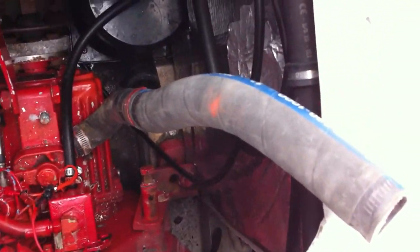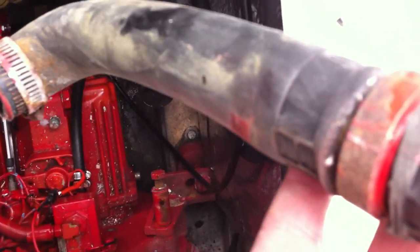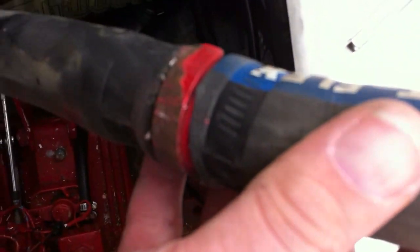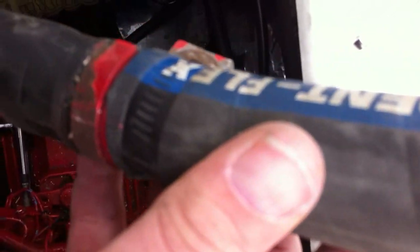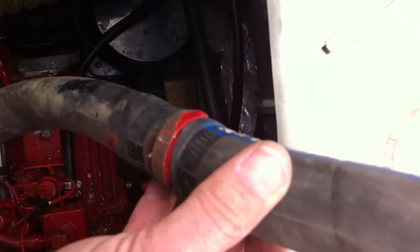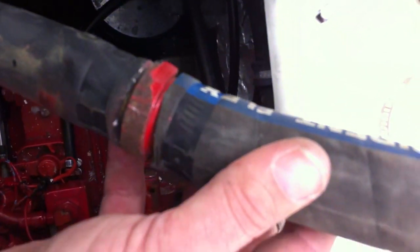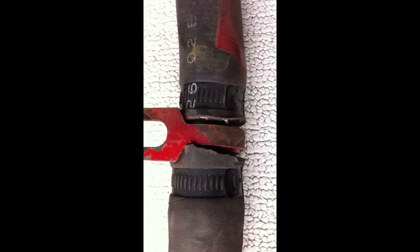Here's the hose from the bottom of the transmission - got it off. This hose has a coupler right in the middle because it takes this Trident 1-inch hose and connects it up to the special hose from Westerbeke. This allows you to hook it into the elbow. The reason they have this coupler is because you might have to put in a different elbow configuration, so you need adjustable length of the hose. I'm going to pull these off with the heat gun and check this fitting, then go order some hoses. Here's the fitting - it connects the output of the transmission coolant cooler section up to the exhaust elbow.